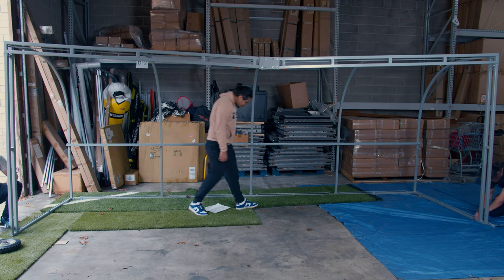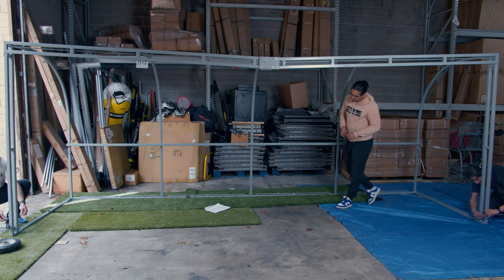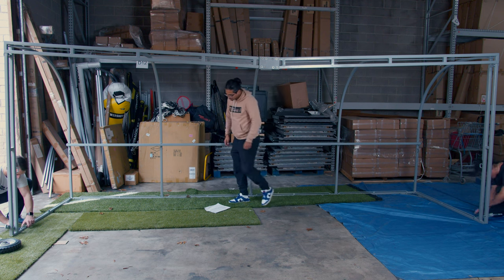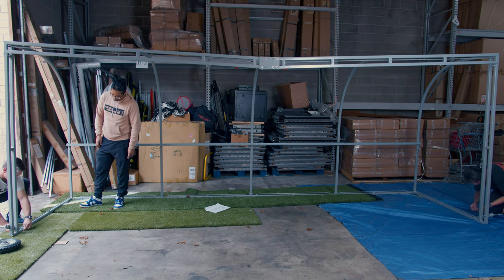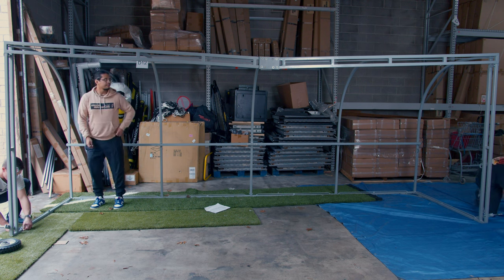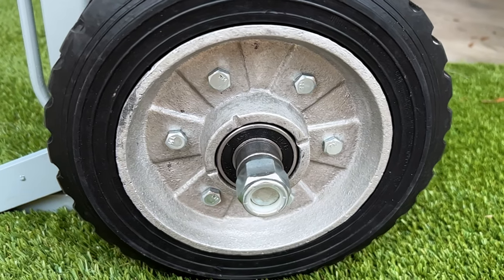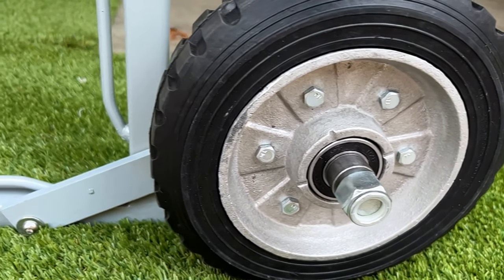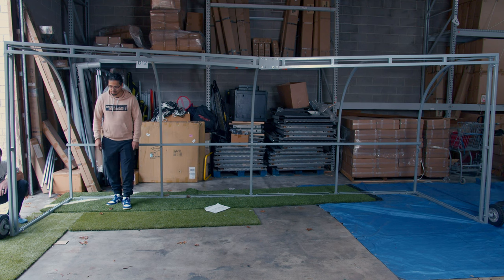And you'll do the same thing, but on the ground level of the frame. As always, we'll take the rounded piece and make sure it's on the outside. You'll put it through the metal frame here. It'll mount through, then put your second washer and aircraft nut. You'll finger tighten it. And now your wheel frame support is here. Easy part is just sliding on the wheel and finger tightening your aircraft nut. And now this wheel should spin.